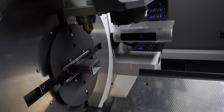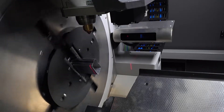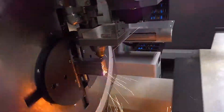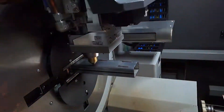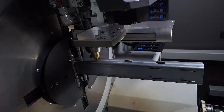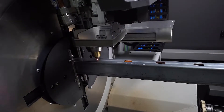And when you want to achieve high speed, quality, and accuracy in every cutting situation, you can use the Quick Cut Quality and the Laser Scan in the same program. On one side, the Quick Cut Quality guarantees the accuracy of cut geometries and the quality of the cut itself. On the other side, the Laser Scan guarantees the precision of the feature position. The device scans the tube, and if the tube is bent, there is a real-time compensation of the head position before starting the cutting process.